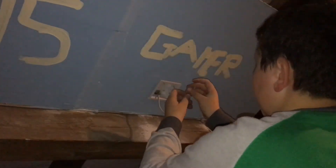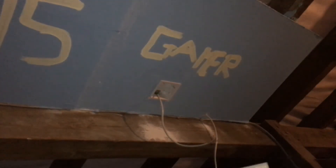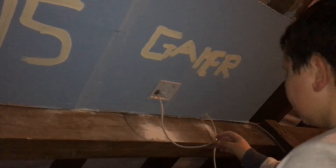What I want to do is put one of these ethernet face plates on. Strip the cable — and then there are all different colour cables inside. Look at the colour code, put it the right way up, and then match each wire — for example, number four is blue. According to your ethernet socket, the colour codes may be different.